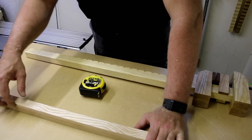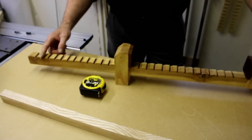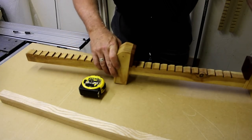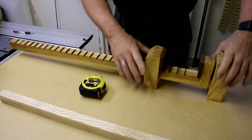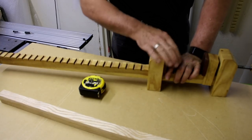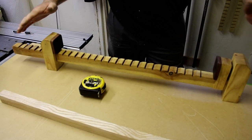I'm milling these down to 91cm long by 35mm deep by 30mm wide. I need to replicate these cutouts on this clamp. This enables full adjustment — when it pushes back into the groove it locks itself in place, making them fully adjustable. They've been working a treat so far.